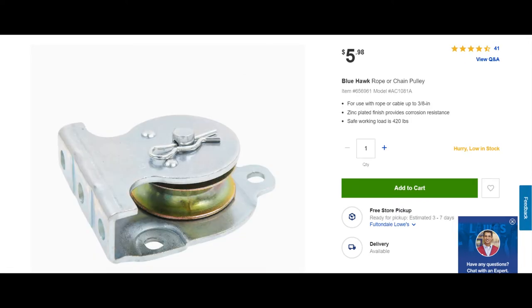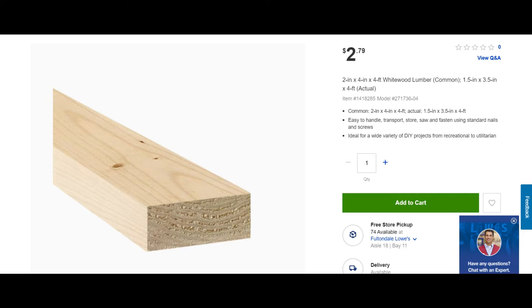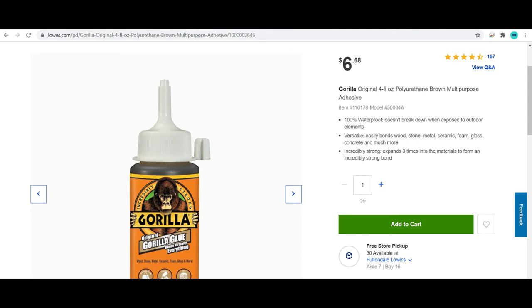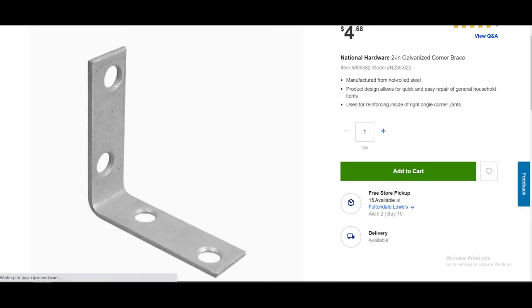You just crimp it to itself to make a little loop. I have one pulley that I purchased and ran up inside the ceiling. I purchased half-inch birch plywood to make the base of the lift for the projector to sit on, and some 2x4s — I only purchased one, cut down from a 4-foot 2x4, to mount my drawer slides and the actuator base in the ceiling. I also used 3-inch and 1-inch wood screws, a long extension cord, Gorilla Glue to hold a ceiling tile to the bottom of the birch, galvanized hanger strap to secure the linear actuator, and L-brackets for the base of the lift.